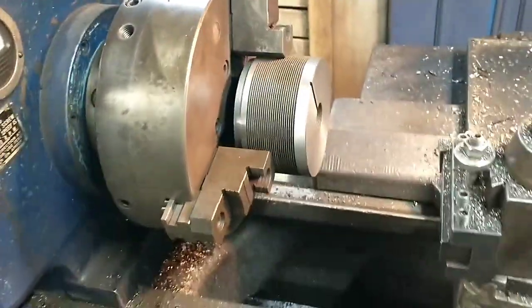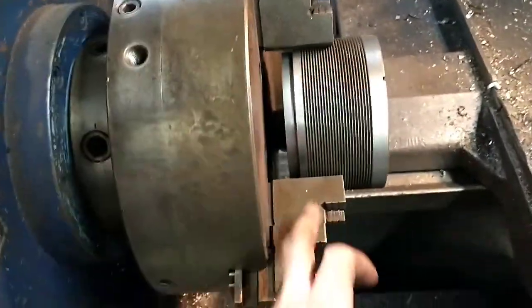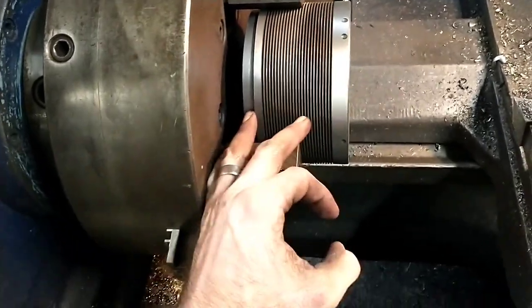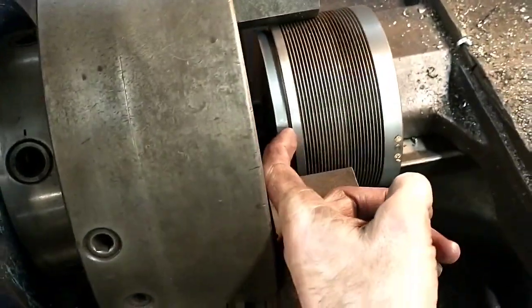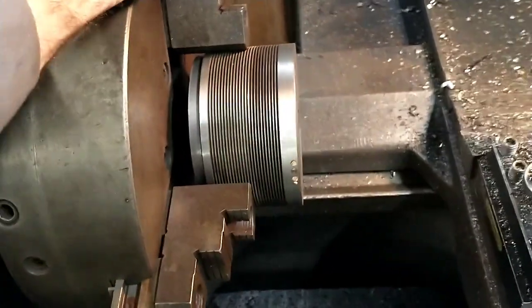We're getting ready to work on that big cylinder project. The bushing was in there too tight to just drive out, so I'm making a pusher. This is some kind of a serpentine belt pulley made out of cast iron I had laying around off some old machine. I've machined it with a shoulder that fits inside the bushing so it lines up square and true. We're going to use it to shove the bushing out and then use it again to push it back in.